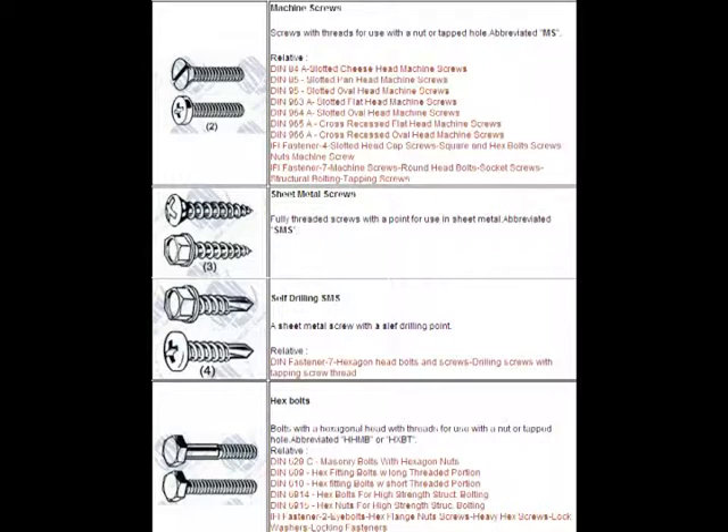The other common fasteners in mechanics are machine screws and, of course, sheet metal screws. Sheet metal screws are pointed and used in things like license plates, into plastic, or into sheet metal — they kind of tap their own threads. Machine screws, on the other hand, are like a bolt — flat on the end and threaded to receive a nut — just like a little bolt and nut, but with pan head, hex head, or oval head styles.